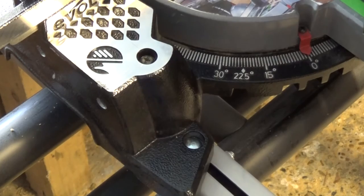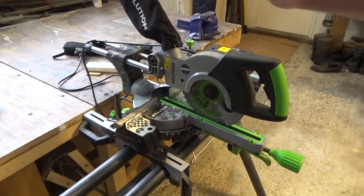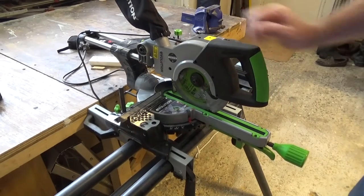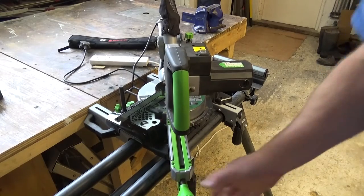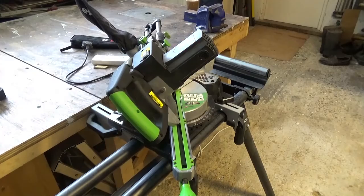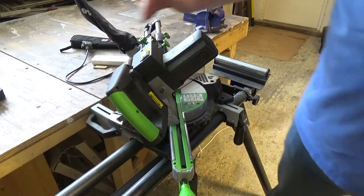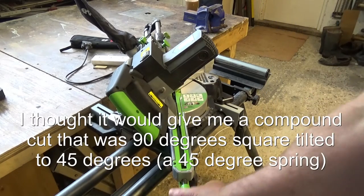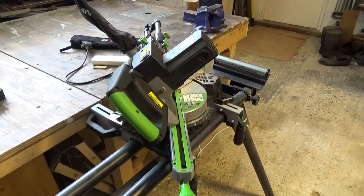That's all there basically is to a normal angle. If you're making furniture there's every chance you're going to need to make a compound cut, which means that you're cutting a miter this way and you're cutting a bevel that way. So you tilt your saw over to 45 degrees on the bevel angle and tighten it up, set your miter angle to 45 degrees, and you're ready to go — but it won't work, and I'll demonstrate to you what will happen when you cut those joints.